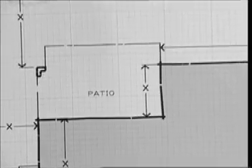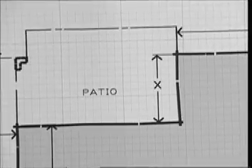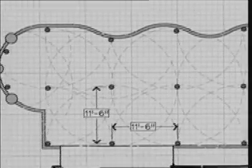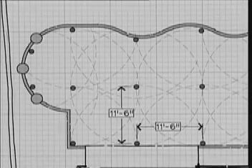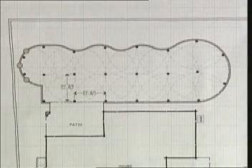Our grass area has been designed to allow for foundation plantings along the house and perimeter walls. Our plan now shows the design of the lawn area. We have measured out the length of the lawn area and determined the spacing of the sprinkler heads. We are using pop-up sprinklers with a 12-foot radius throw, but locating them at 11-foot 6-inch intervals to achieve head-to-head coverage and allow for normal fluctuations in water flow. Sprinkler heads are designed to spray in an overlapping pattern — at least two heads should be spraying back to each head, assuring full coverage with no dry spots.